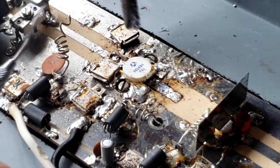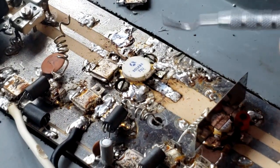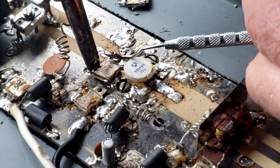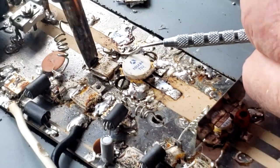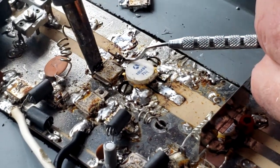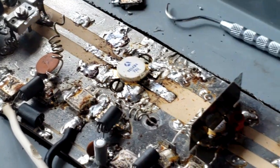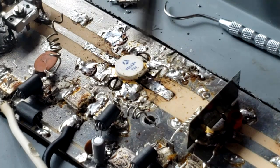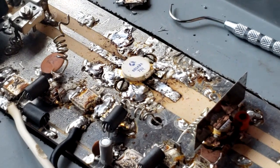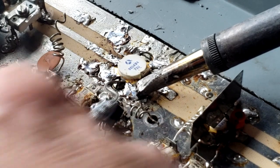All right, we put the heat to the capacitor and it just popped right off. And we're going to do the same to this capacitor. I'll hook it here and help pull on it. Once the whole chassis gets hot enough, it pulls right off like that. And so now we have open area to work on the transistor itself, and we'll use this pick and we'll continue on by heating up each of these areas,